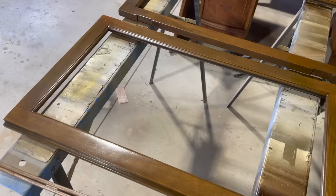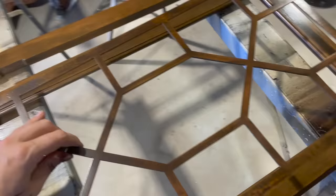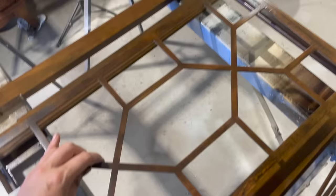We've got the doors here under their third coat, second coat on this side. So I'll probably need to sand those and do another one. Tricky part about doors like this is matching your lattice work when it's not together. So I'm always just careful to see. Looks like it's gonna work. It goes behind the glass, so I've made it a slight bit darker just because the glass kind of mutes the dark tones.